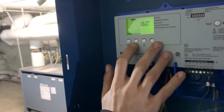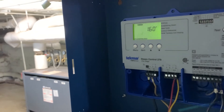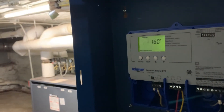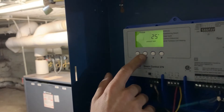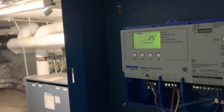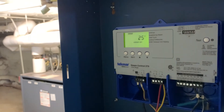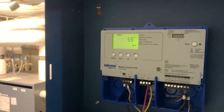It would still respond to all the boiler controls — if it reaches pressure the boiler will still shut off, it's not just going to continuously run. Item again — 160 degrees is for steam established, I'll show you where that sensor is. Steam is obviously over 212 degrees, so this is kind of low. The default is 180 but I lowered it to 160, so when that sensor reads 160 degrees it begins the cycle. Lockout differential is 25 degrees — so if that steam sensor drops 25 degrees, down to 135, it would turn the boiler back on.